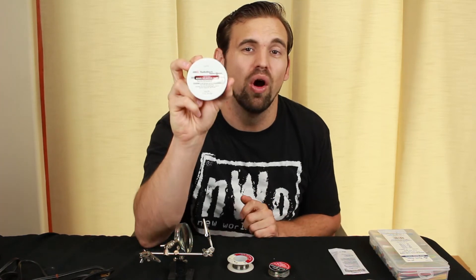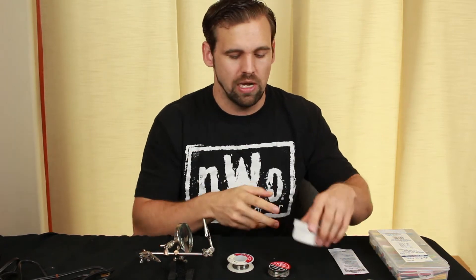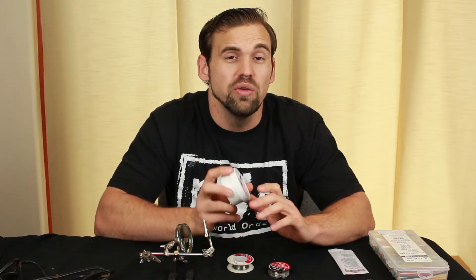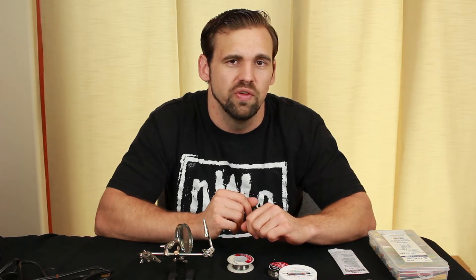One of the things I find useful is to have my own flux as well. This is Rosin soldering flux — I picked it up from Radio Shack, which no longer exists in the US. Flux is really good for improving solder joints and getting solder to flow smoothly. I use soldering flux mostly for work on PCBs, especially with surface mount components, because the flux really helps solder to flow a lot better. It can remove oxidation from old solder joints, allowing your soldering iron to conduct better and remove solder more efficiently.